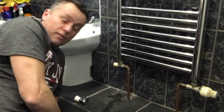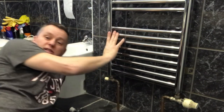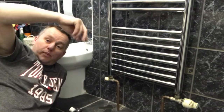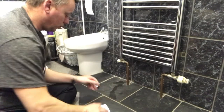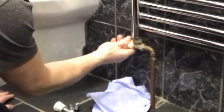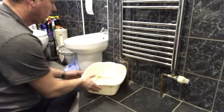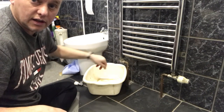This is running on a combi boiler system, so the system is pressurized. It's still a little bit warm but hasn't been on for about half an hour, so it's cooled down a tad. We've got to release the pressure in the radiator, so we'll go to the top and just crack off the bleed valve. Let me mop up this water first. I'll shove my bowl under there — when I crack off the top the water should dribble into the bowl.